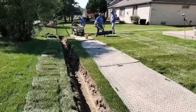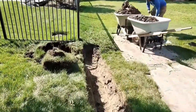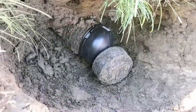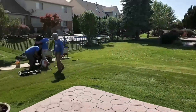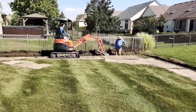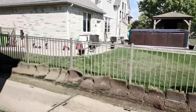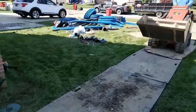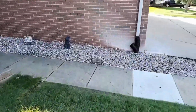If the developer had to turn in plans with drain easements to build all these homes, how do you get approval if there are all these water problems? It starts at the storm sewer. The storm sewers are tied to nothing — they're there for bulk water, basically flood water. If there's standing water running through the backyards through these swales, the top of those basins will take in that flood water. But for water stuck on the property lines and down the side of the house, those basins aren't going to do anything unless you do a French drain system and a roof runoff system and get it directly to that storm drain.